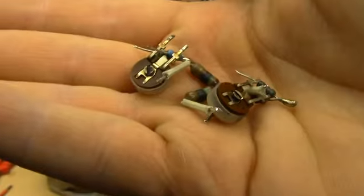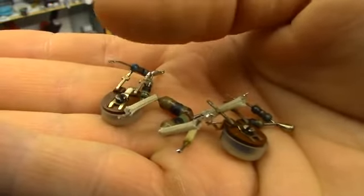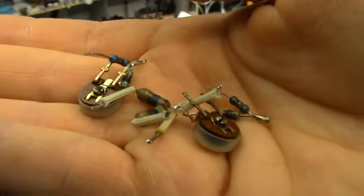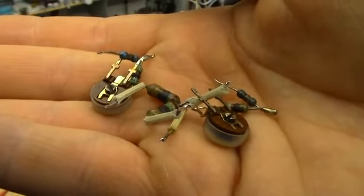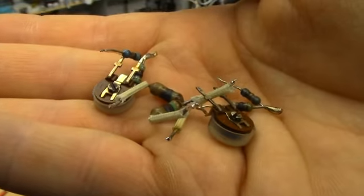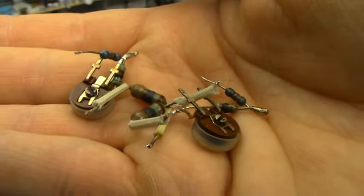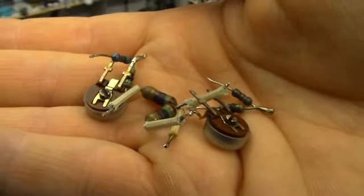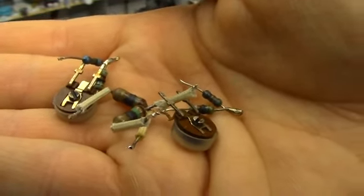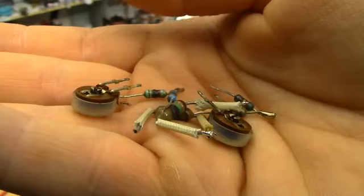Right, so I've now extracted a literal handful of components out of this device, and I was actually wrong in my initial assertion. These potentiometers are actually the DC offset potentiometers. I had already replaced the bias parts, so I'm not entirely certain as to what's up with that. I probably replaced them, then put this thing aside waiting for parts or something, and then forgot about it, and now I have no idea why I put it aside to begin with. Possibly because I've received a few capacitors I intended to put in it, but I put some other ones in there instead.